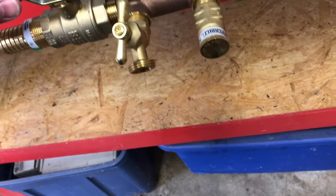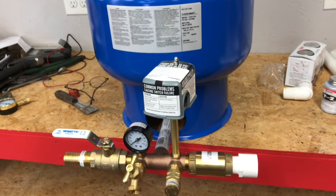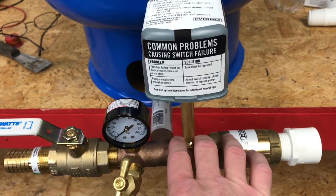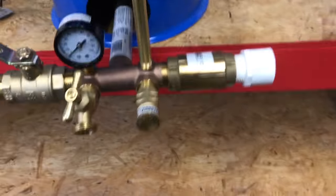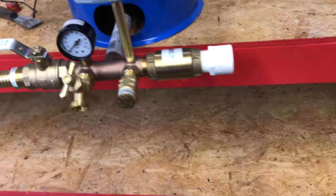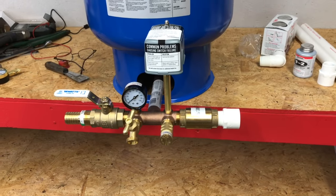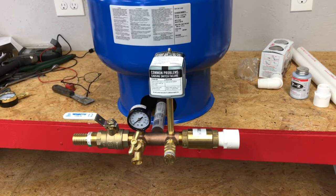So guys, that's about all of the items that you're going to need to hook up your new water tank, and this is the fashion that you would hook it up. It probably wouldn't matter which side the gauges were on — you just want your one-way check valve from your well water coming in, and the rest could go either side if you wanted. That's basically about it. I'm going to go ahead and disassemble all this stuff, put the Teflon paste on it, and tighten everything down good. I'll get everything built up right here on the bench before we take it out there and install it.